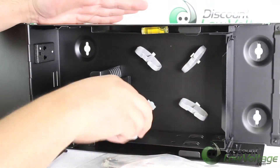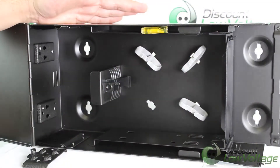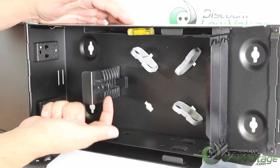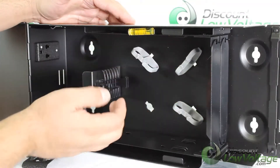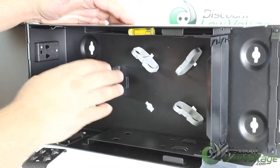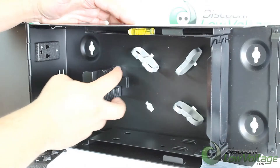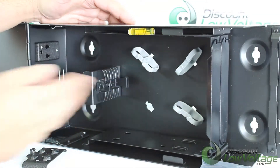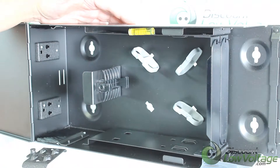The cable retainers are removable, so if you want to fill it with cassettes you can go ahead and do that. This feature is also there in case you install cable with a loose tube fan-out kit — the end of the fan-out kit would pop right in there and stay nice and neat so you can keep everything organized and it doesn't become a rat's nest wiring nightmare.